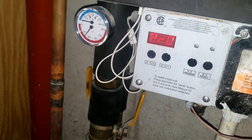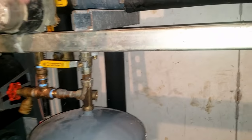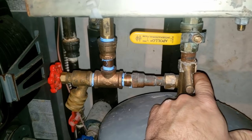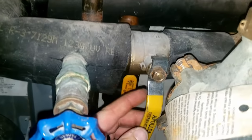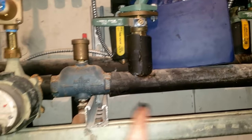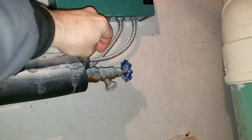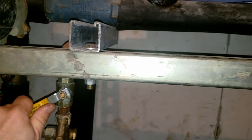So now it's working. We need to clean that thing out. Our fill valve is not filling, and the pressure on this boiler is nothing — it won't run unless it's got water pressure on it. I'm going to open up my little bleeder here, that's probably gummed up. Get this screen opened up. I've got valves off here, water open here, valved off back here, valved off at the pumps. I'm going to force any air out. We like using refrigeration stems to bleed boilers — it's cost-effective and it works.